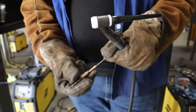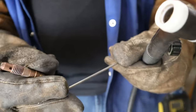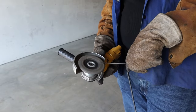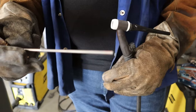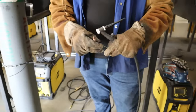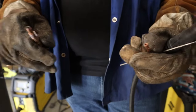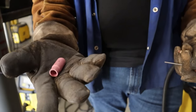This piece is the tungsten itself. You normally want to keep this sharp like a pencil. This is what we call thoriated tungsten — it has the red tip. This one is actually radioactive. This right here is what we call a collet, and this is a collet body. This is your cup — a size seven cup that we have right here.